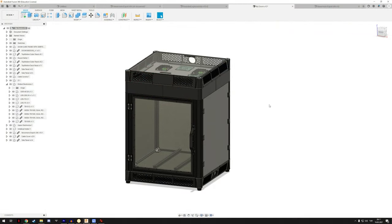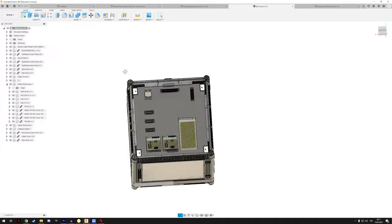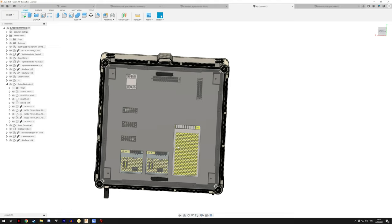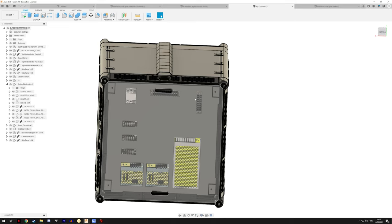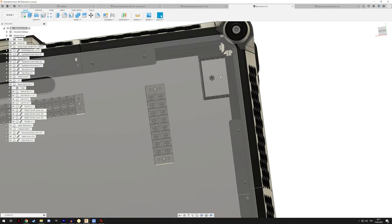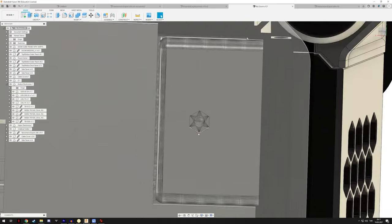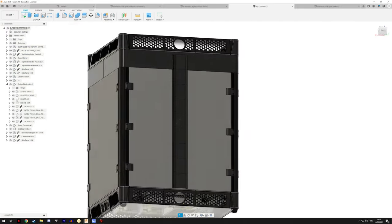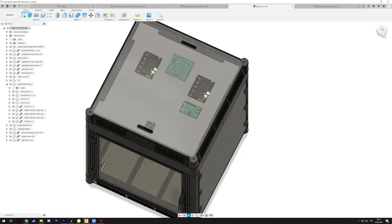I played with the CAD model a bit more. Overall you can see what changed — I modeled all the electrical components on the top and bottom. We have the power supplies, terminal blocks for live, neutral, and earth, and a terminal block here for a breakout to make wiring easier. I also put the idlers on this side — you'll notice these are meshes imported, because they're not modeled in the CAD release I have. On the top we have the two SKRs here — these are 1.3s but as I said I'm going to use the Mini E3 V2.0 for one of them.